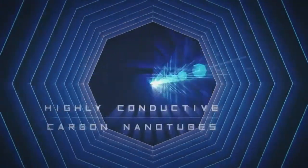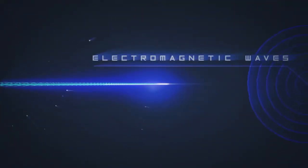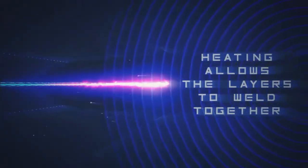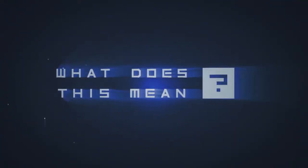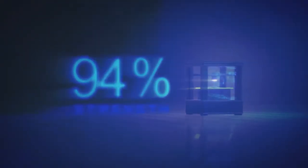So how does it work? It's a two-step process. First, we coat the filament with a thin layer of highly conductive carbon nanomaterials. Next, using our patented FlashFuse technology, we use electromagnetic waves to excite the particles in that thin layer, causing the layers to react and heat up rapidly. This heating allows the layers to weld together. We now have the ability to weld an entire printed part together during the printing process, achieving up to 98% the strength of an injection molded part. No post-processing — you take the part off the printer and it's ready.